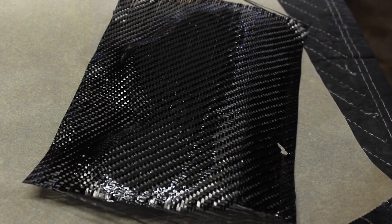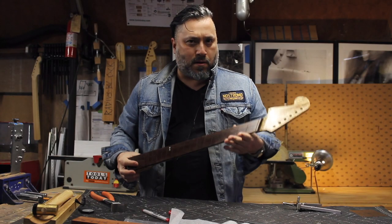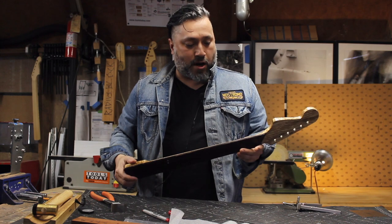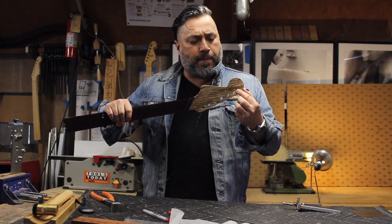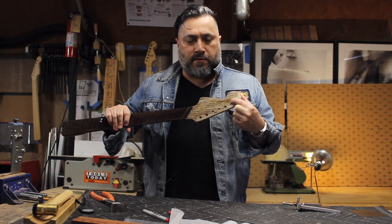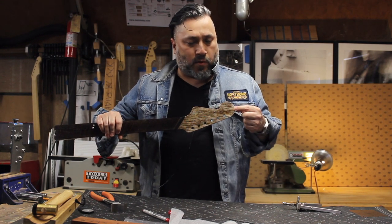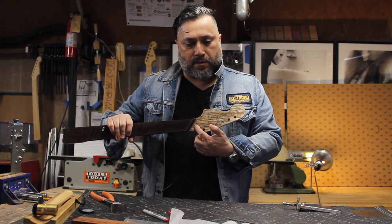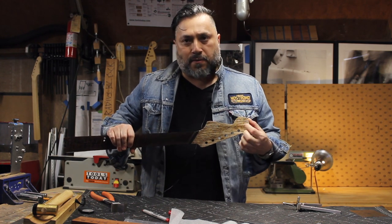This is going to cure overnight after the third coat, and then we'll start to sand down through all the grits — probably up to 1000 or 1200 — and then buff it out by hand. This material wasn't hard to work with; it just required a little bit of extra care. Along the short fibers, the hemp wood is quite brittle. Along the longer fibers it's fine, no worries there. But any time there are short fibers in those sections, it's going to be a really brittle wood.